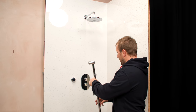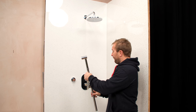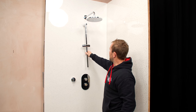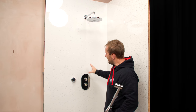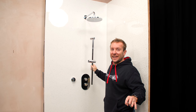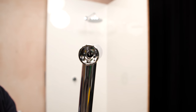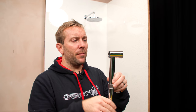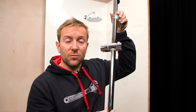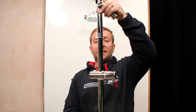We're getting to that brilliant stage now. Remember what I said — we've got a centre here. We measure this distance here and that's our centre. I'm going to pop the rail on the side here so the hose doesn't get in the way of the valve. This is a really simple setup — if you look through here, you'll see we've got a hole all the way through. We pop a screw straight all the way through, and we do that at the bottom as well. The main thing you want to do when you're doing this side of things is decide what height you want, and then use a spirit level to make sure that these two are in line so we've got everything nice and level when we fit it in.